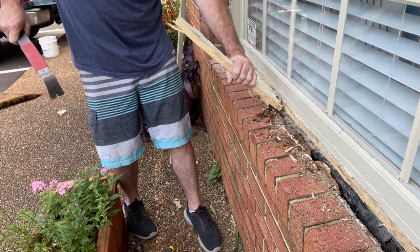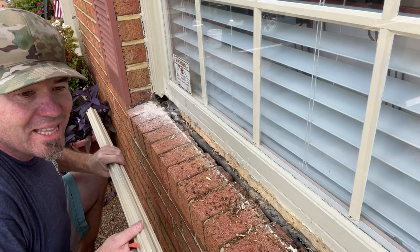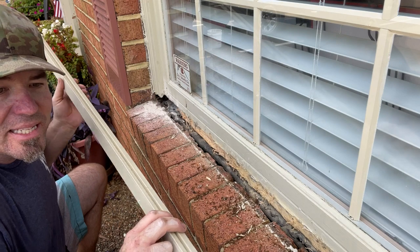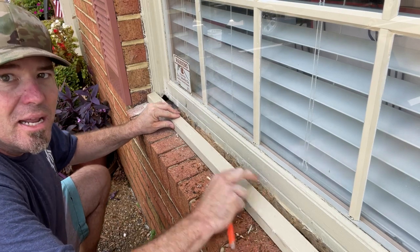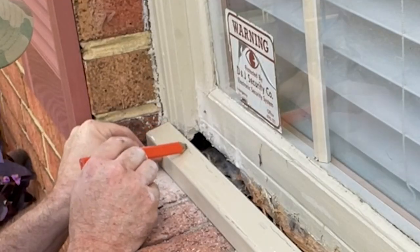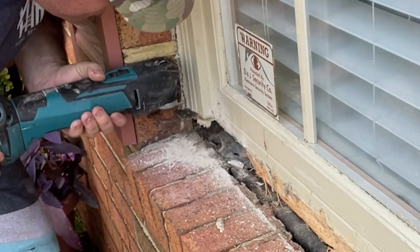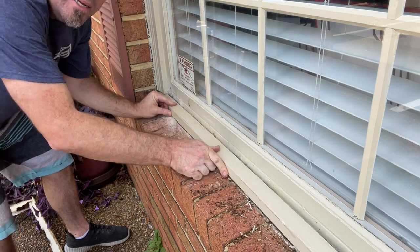From 22 to 7, I've got four daughters — okay God, thanks for trusting me with them. Now I'm going back with this vinyl sill nose — it's like PVC. I primed it and it's actually a two-part system, and it's going to work perfectly for this situation. The reason I didn't cut these guys is because I need this new sill to slip under this brick mold. So I'm gonna lay it up here and mark it so my new sill slips up under there just like so.